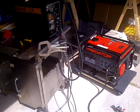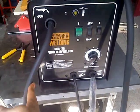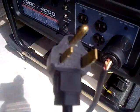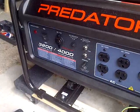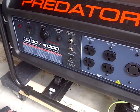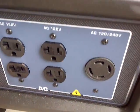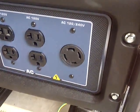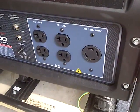Hello everyone, welcome back. This is a continuation on the MIG-170. As you know from last time, the receptacle on this doesn't quite match with this here, as you can see. This is the plug here, and this is the plug on your generator, at least on this particular model here, the 3200 continuous, 4000 watt max. You've got all these outlets here — 120, 120, 120, 120 — and then you have this one which is 120/240. It turns out there's not too many adapters out there that you could just buy off the shelf and use with your welder.